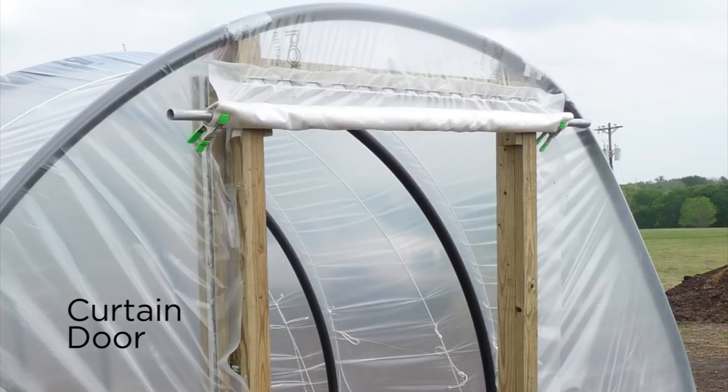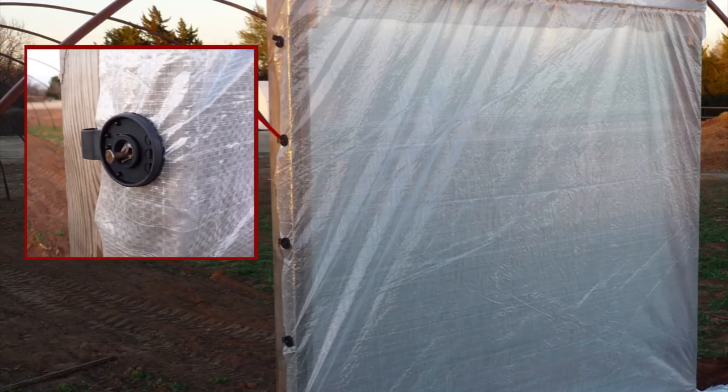For a large house, the curtain door — the structure is strong and the door is just cheap. You get what you pay for. It operates just like the vents on the side of the house — roll it up, roll it down. When I was in Israel, I noticed some Israeli growers were tacking the film to the column using little griff clips, running a nail through it, and pulling it on and off by hand. Time-consuming but cheap — just understand the limitations of the system.